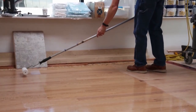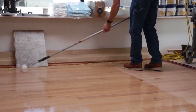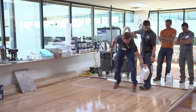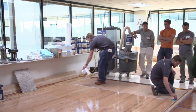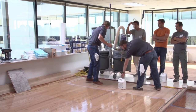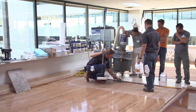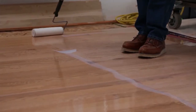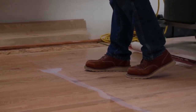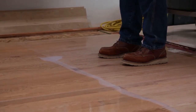We chose Extra Mat — our most forgiving and most well-stocked material in our facility. Now I can pour my edge along here, knowing I'm going to work out the door, keeping that wet edge key. In this case I don't really have to worry about cutting in. I don't need to feather out with the grain because I'm going to roll right back over that. I may wet out the area a little bit, then reach back in further with the grain, and feather out that area.